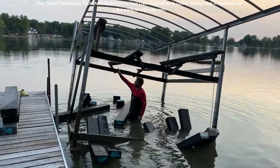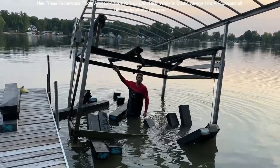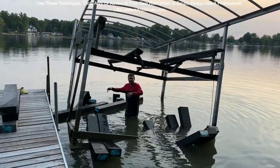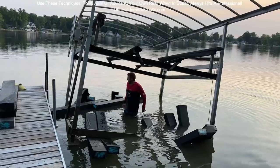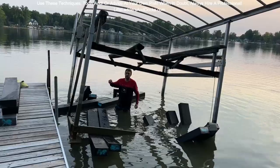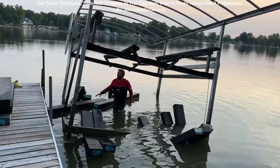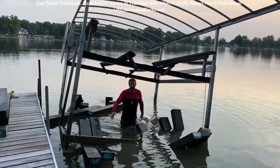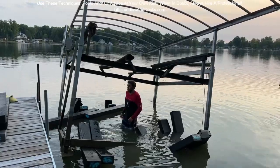But the winch corner is where it's always going to want to dip. Even a bare canopy frame is going to catch some wind. We got a really, really calm night tonight. We got lucky, but once it starts tipping a little bit, that's when the floats are trying to get out of the water. They can shoot to the side and then it can kind of go on you. So having these on the side, especially because we're going out and around a bunch of docks into some deep water to an access point, we're going to have a few there just to make sure, even if these do start shooting sideways across this horizontal bar, that we still have our two or three safety ones in that corner so it can't possibly dip down there easily.